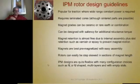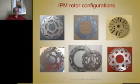The IPM design shapes are very flexible. You can use straight slabs, V's, U-shaped, W's. You can add empty slots. You can have multi-layers to increase saliency. Here's some examples of how creative you can get. Here's a double-layered magnet IPM design with big salient poles in between. This was developed, and they even did some shaping of the lamination on the OD to have a variable air gap to improve the sinusoidal back EMF. This was developed by Oak Ridge Labs for traction application.